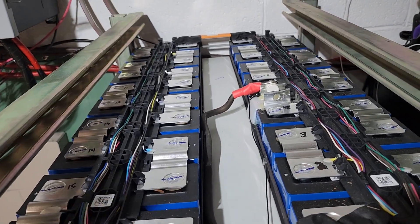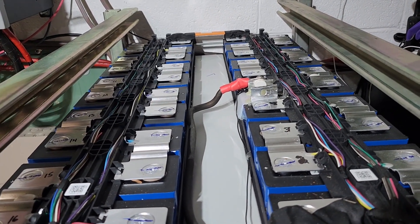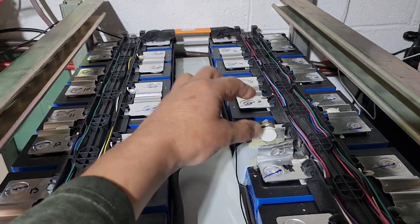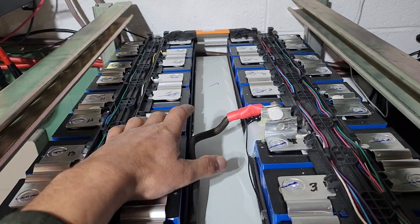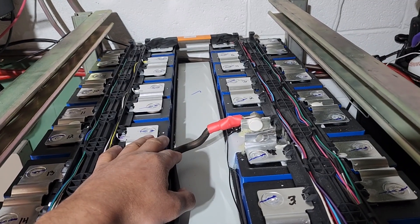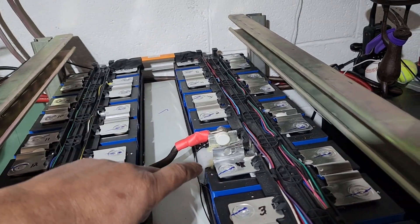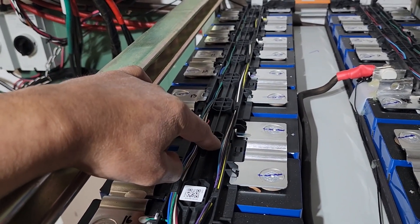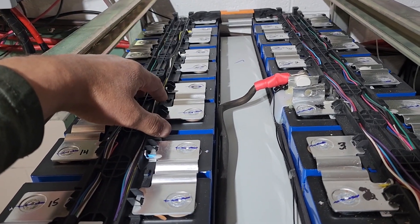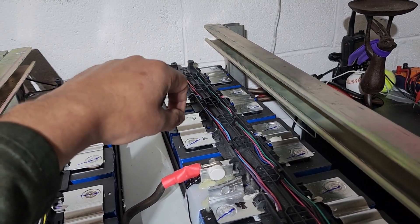All I had to do was tap into that. For those connections I used quick connects — dolphin style — with gel already on them. They're cheap on Amazon; I'll try to put a link up. Not affiliated with any of that, but that's what was recommended by Battery Hookup. So from the top down, this is the four cells I'm left with. This is my negative — a four-gauge cable. I ended up using the same distance on all the different packs. It's a flex silicone-type cable so it can handle quite a bit of amperage. Haven't noticed this stuff getting hot. One piece of advice: if you're doing BMS wiring and trying to use the factory wires, cut one at a time and take the voltage reading off each one, because they're all live and you might short something out. Cut one wire at a time, measure the voltage, make sure you've got the right color, and then wire that to your BMS.